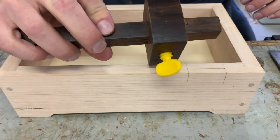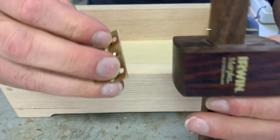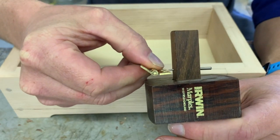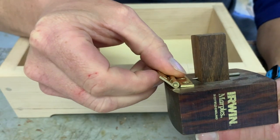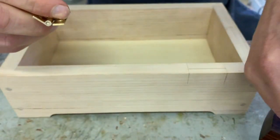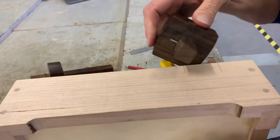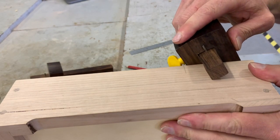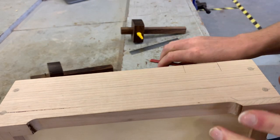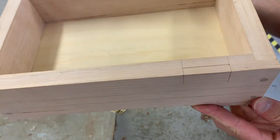Now it's always a good idea to get two gauges — usually this one for your 8mm. I have a second one here that I'm going to make 1.5mm. Now instead of trying to measure 1.5mm really hard, I'm actually just going to put the hinge straight down on there like that and put that pin right up to that point there. I'm going to undo that, push that up, get that pretty close, tighten that off, and then keep checking it until it's perfect — just tapping that on the table. And I have that spot on, set to 1.5mm. Now I'm just going to scribe my line. You want to do that nice and carefully, and then I can put my pencil line in there. Now you can see that I have marked that all out — it's ready to be chiseled out.